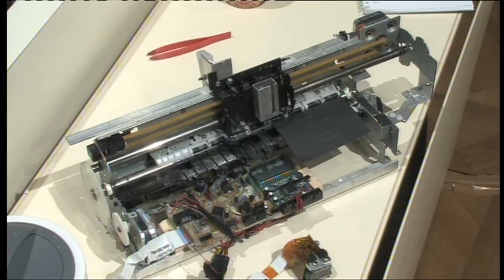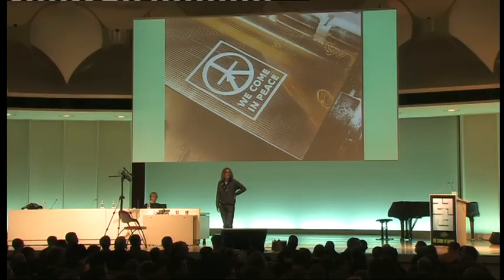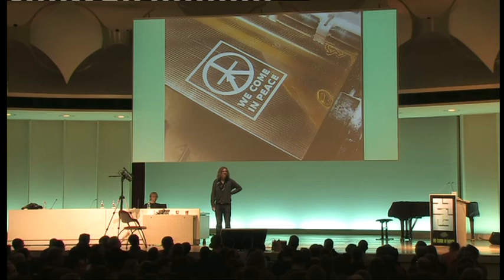One more question: wax melts in heat, but most etching solutions are used at elevated temperature like 50 degrees — doesn't the wax melt in the etching solution? Good question — yes, if you turn up the solution temperature too high then the wax melts. This wax melts at about 65 degrees Celsius and is being printed at 70 degrees Celsius. The etch solution works well at 50 degrees, which is below the melting point of the wax, so we etch at 50 degrees Celsius.